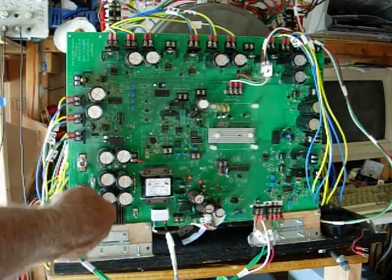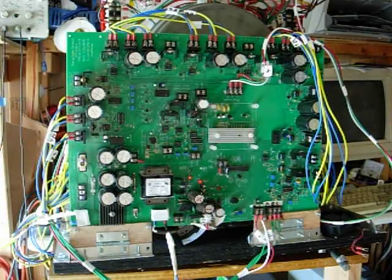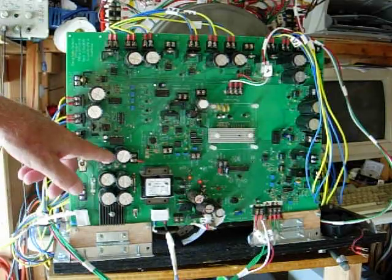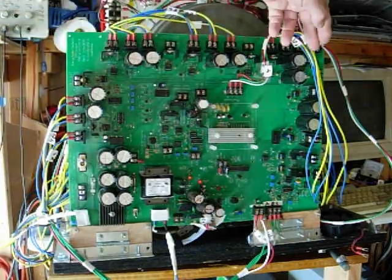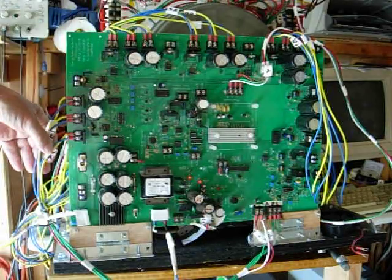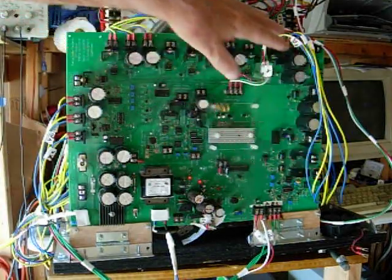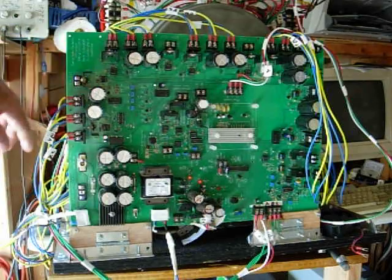This whole area here is for the high voltage power supply. That's putting out now about, I think, about 60 volts. The variac's sending out 50 volts into this sine wave, and then each one of this one here, this one, and this one, those 4 things are for the 4 ECM generators. I haven't adjusted the timers on the pulses that do the loading and dumping of these caps out these connectors.